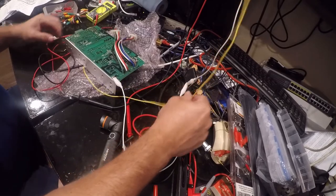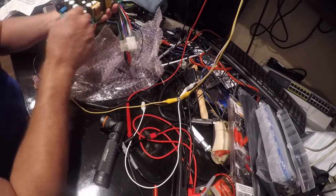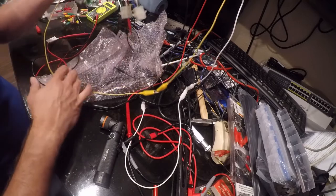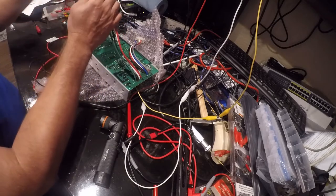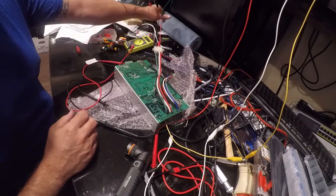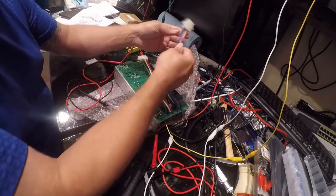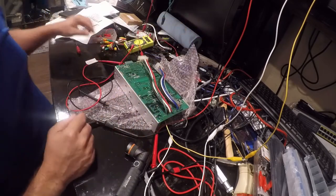So I've got 3 volts coming in here, and I've got it connected to this test point down here for the time being, because I just want to identify some stuff. And I spent some time kind of analyzing this. I've got leads on what would be the hot and the neutral. I need some more test equipment before I can really power this board up and test it. So for right now, those are just test points. I've determined that the white wire is connected to the blue wire, so that's neutral on the output plug that goes to the servo drivers.